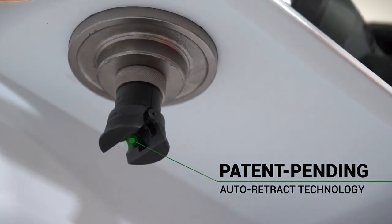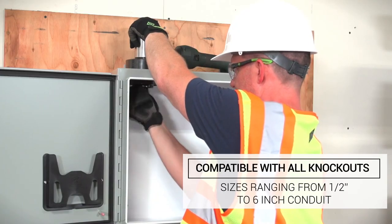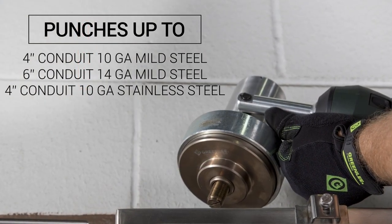The hydraulic system operates in a cycle of eight seconds, and a removable head allows using the tool with other hydraulic nozzles of the Greenlee series. After setting the punch to the required size, the hole is cut automatically in three to five seconds depending on the thickness of the material.